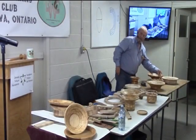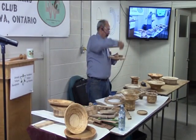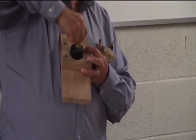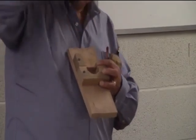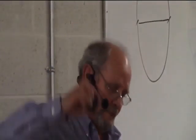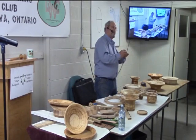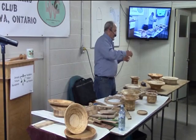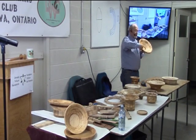So I got a hole saw and made a little jig. I took a piece, put it into the jig, came down with a drill press, and it goes all the way through. Take out the two pieces, set them aside, and do it again as many times as you need. This cuts with a kerf of one-eighth of an inch. What I did: I took two pieces of sixteenth veneer, pressed them together, pushed them into the space, glued it, clamped it up, let it dry, arranged the pieces into a ring, and then turned it. You end up with a very nice pattern around the outside.